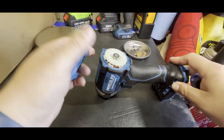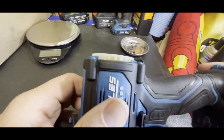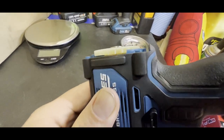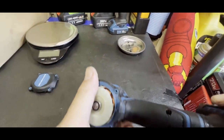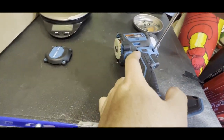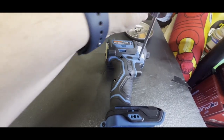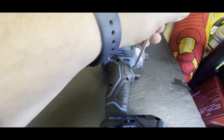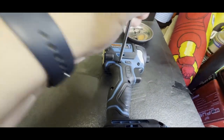This is just a bearing cap. That's your fan, and it does look like it's a bi-directional fan, so no matter which way you spin the motor it's going to cool. On some of the cheaper ones they usually use a single-directional fan, so it won't cool as effectively when spinning a certain direction.